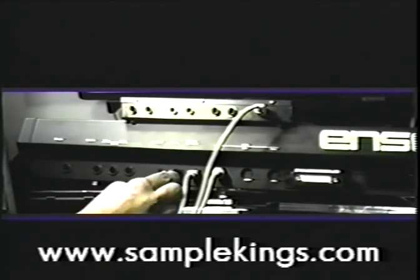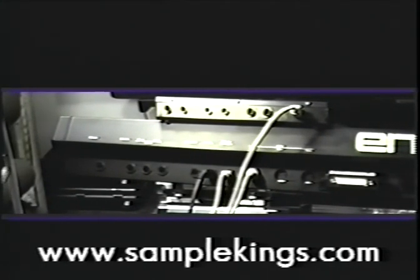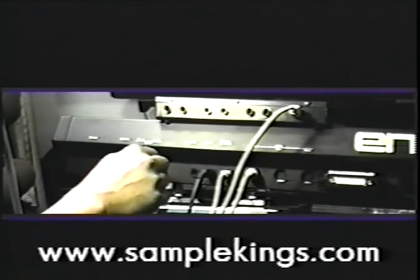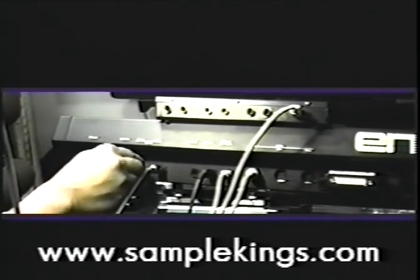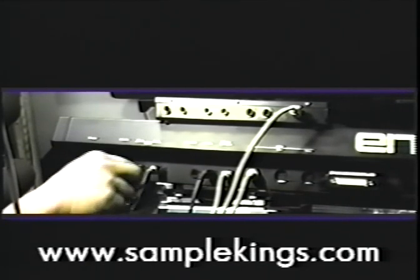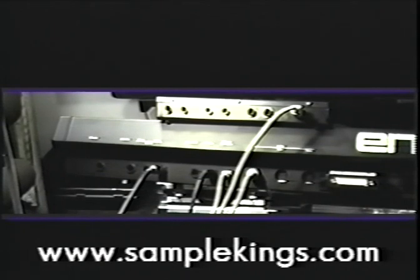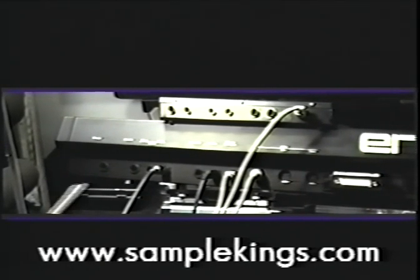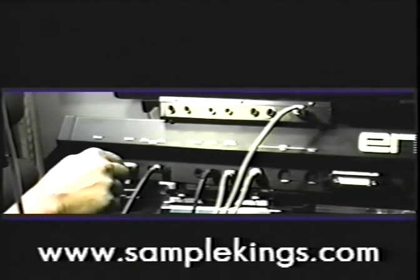We have our left and right outputs, which can be connected to a home stereo or a mixer. The output from these two jacks can be used in stereo or mono. But if you decide to use mono, use only one jack. Do not use both. Next, we have our audio in for recording samples into the EPS. This jack can be used for either line level or microphone level signals.